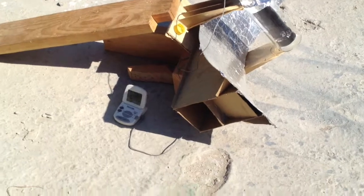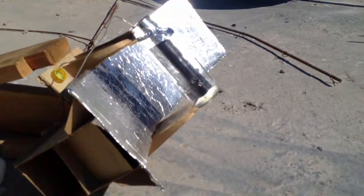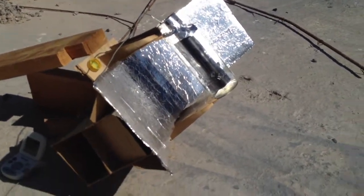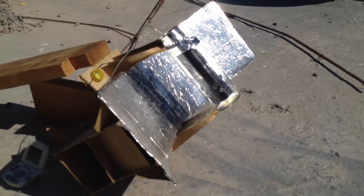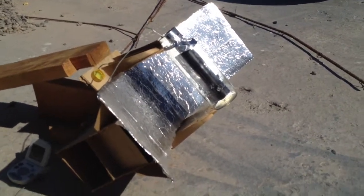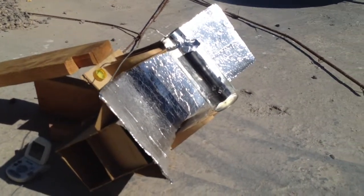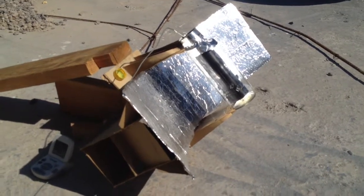The test piece is now ready, heating up with the glass. You can see there's an air pocket which is going to insulate the middle, and this should hold heat better, especially at high temperatures — it'll be less of a heat loss. This is what I want in the solar thermal trailer, where I'll be running at 150 or 200 degrees Celsius. I'm hoping this will almost double the power by losing less heat at high temperatures.